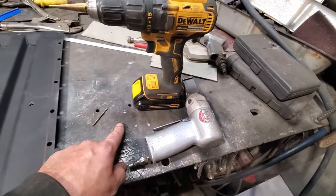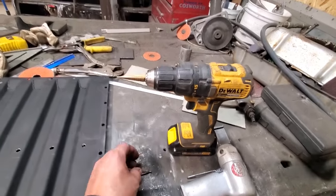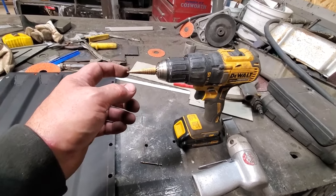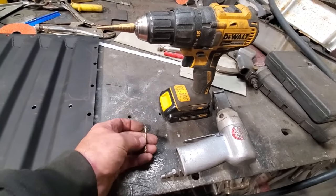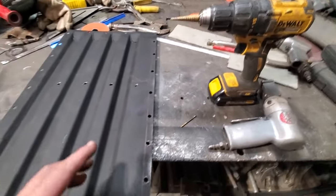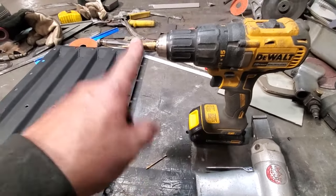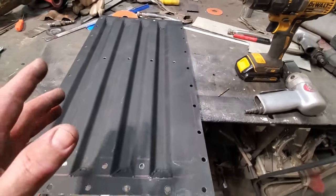And drilling spot welds, I use a 1/8 bit first, which drills a pile of holes, and then I use the step drill. I find the 1/8 drill on the end of them wears out fast, and it's not as sharp as a 1/8 bit, and that's all I've ever done. I've gotten into the habit of drilling all holes first with a 1/8 and then upsizing to either a step drill or a drill bit. I just find it faster.